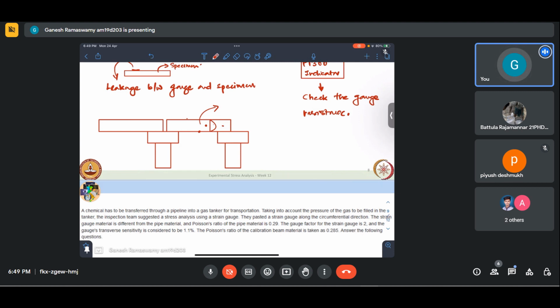What will happen if I make the plate very thin? As we saw, in case of pure shear, at the neutral axis I have the maximum shear stress, which is tau max. So I have a stress element like that. This can be represented as tau max like this and tau max as compression, by simple transformation. So let us say that I went on economizing this and made the plate girder very thin. This is compressive stress. So in case of a very thin plate girder, compressive stress can lead to buckling, local flange buckling. So these are very big problems.